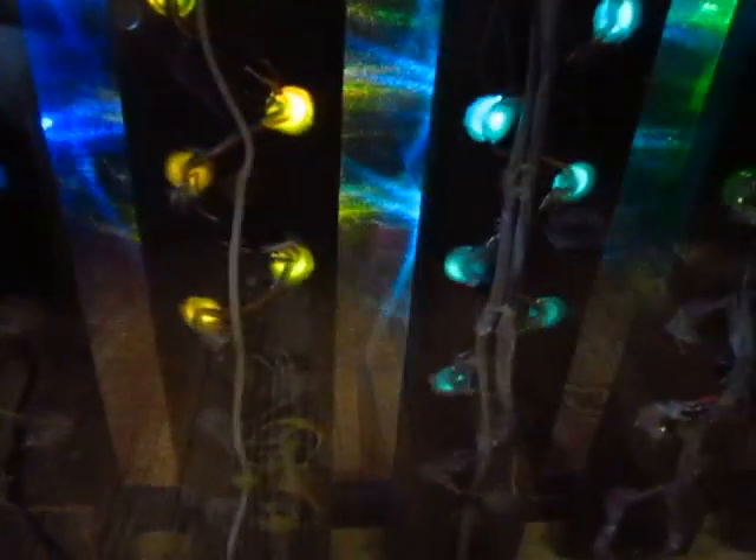I built most of the electronics as well. Tipping it over here, you can see where all these addressable RGB LEDs got installed. Right up here is an 11 amp-hour, 6-volt battery. I can run this table for about four days off of it. This little project box has the spectrum analyzer shield and controls for the things on the side.